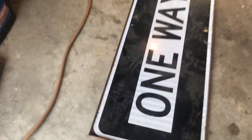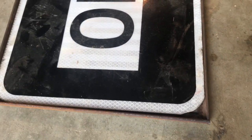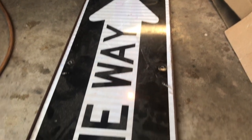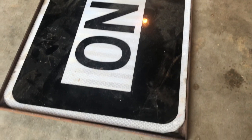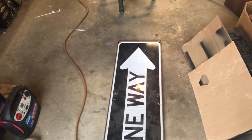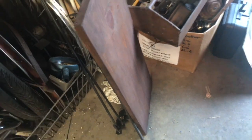I think we've got — there's a little bit of a gap where you can see a little bit underneath there. I think I can probably buzz that or put a piece in there with the rounded corner on the sign. This is the corner that's kind of buggered up and kind of damaged a little bit. Take a hammer and beat as much of that out of there as I can. I'd say that frame is pretty much ready to weld up. And then I just need to make the two cross pieces that I'm going to put in there to give it some strength after we get it welded up.